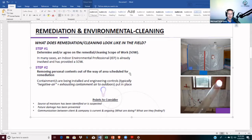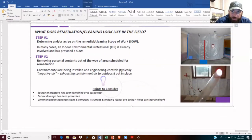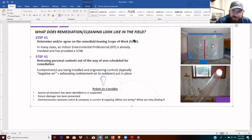For smaller containments where the pressure gets too great, we can put relief pre-filters taped onto the plastic with a cut door to allow some make-up air in while the zipper stays closed — because you don't want so much pressure that it rips the containment off the wall. We use really sticky double-sided duct tape and staple into drywall. It's so secure that when you pull the containment down after clearance, it can take paint or even pieces of drywall off the wall. That's easily fixed. What's not easy is if a containment comes down mid-project and you have to clean the whole house.